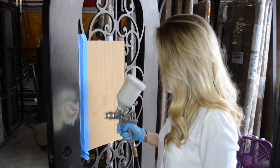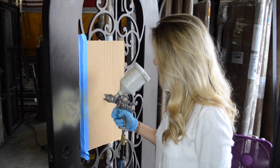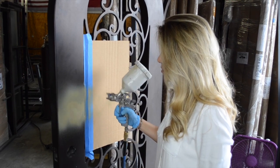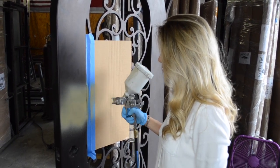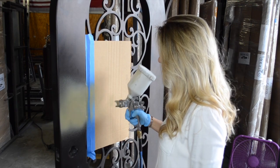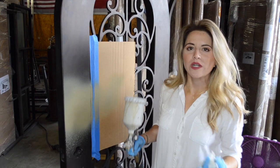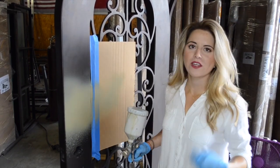Spray through the area as smoothly as you can to cover the whole thing. You don't want to make it too wet though. We recommend doing two coatings — let the first one dry out and then start with the second one, so you can make sure it's all smooth before the paint.